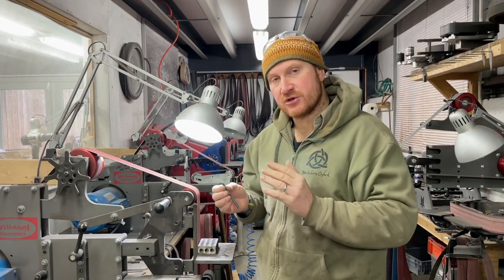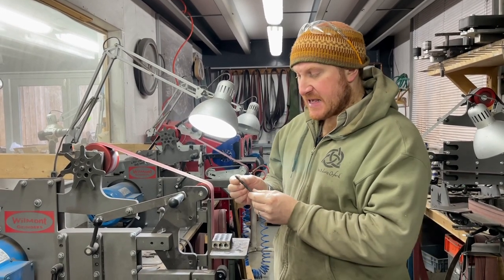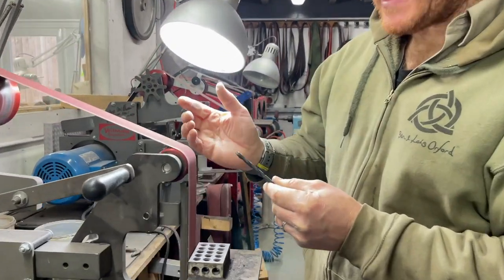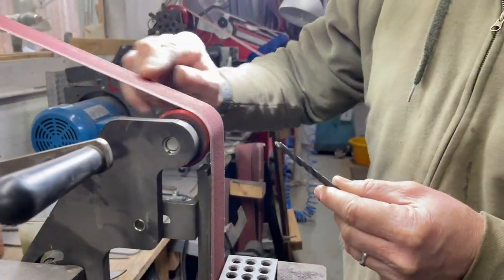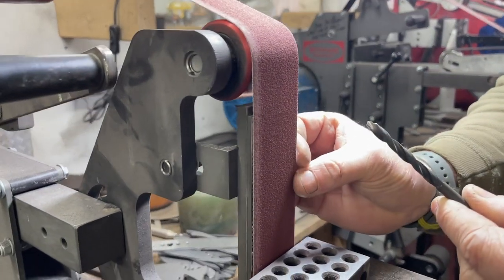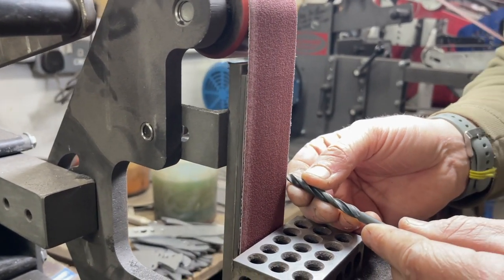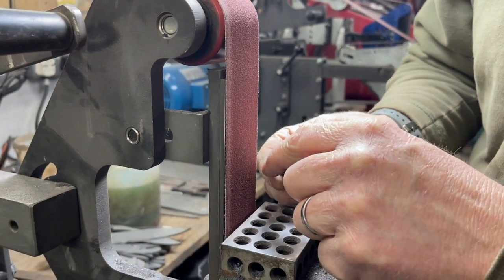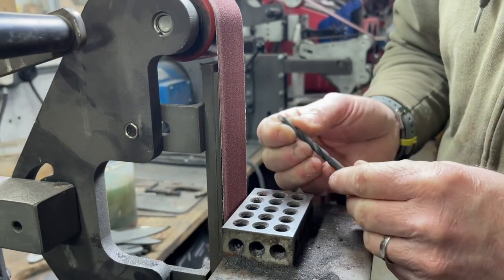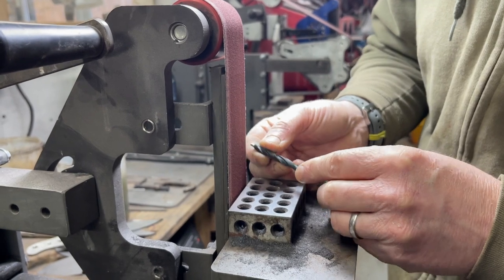So now we need to sharpen the drill bit. You can refer to our sharpening a drill bit video as it's pretty much the same technique, the only difference being that we've got this central shaft in the way. I've moved the belt so I've got a really hard, crisp shoulder hanging over the platen just ever so slightly, and we're going to start cutting and creating a slightly flatter cutting edge because the bottom of the counter bore doesn't want to be too tapered. Then we can remove some of the excess material from behind.